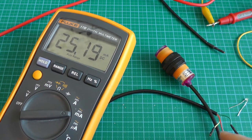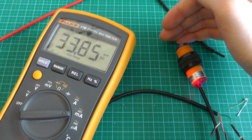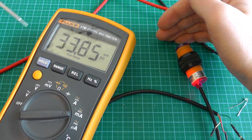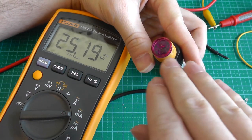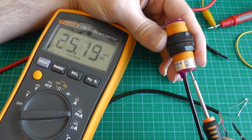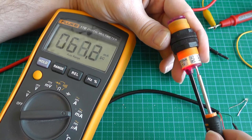The problem I have with this range detector is that the LED is constantly on, so it constantly draws power. As we can see here, when it's just standing there it draws around 25 milliampere. And when something is in front of it, you can add another 8 milliampere because of the red LED. If I want a battery-operated device, drawing constantly 25 milliampere is really a lot of energy — I need either huge batteries or I need to change them very often. This 25 milliampere depends on the range you want to use — if you turn it, you extend the range and the device draws more power, because the LED is brighter.